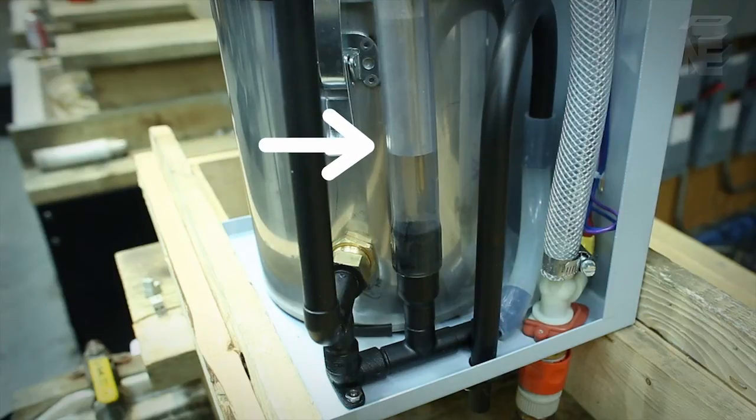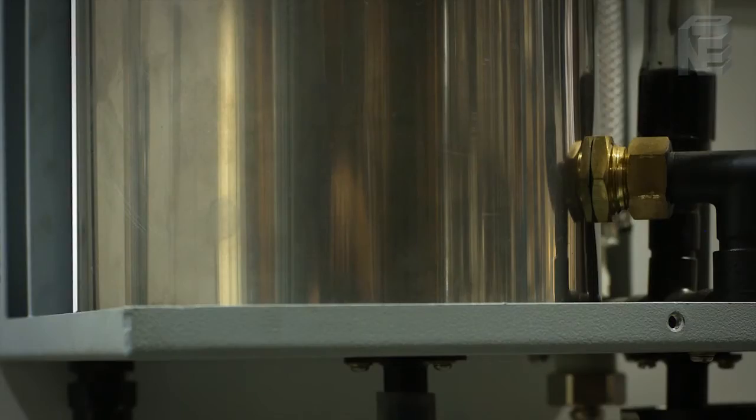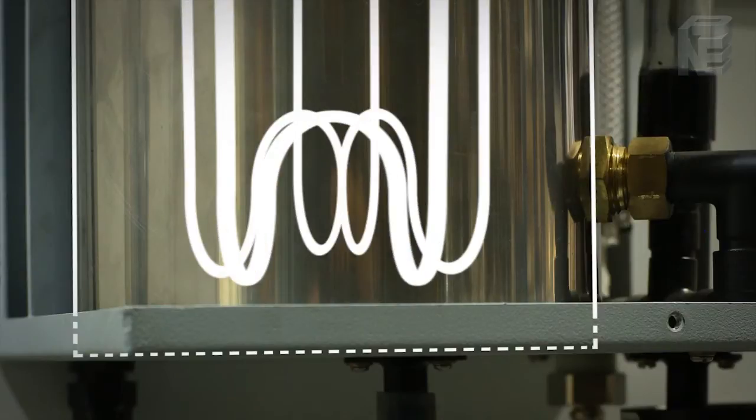The level of water in the cylinder can be seen in the clear silicone hose, which houses the level probes, to the right of the boiling chamber. Note that there are several inches of water in the chamber as the drain port is located on the side wall of the cylinder, up several inches from the base. This is to prevent any mineral deposit from blocking the drain port. During the operation mode, the mineral deposit falls to the bottom of the chamber and accumulates there.